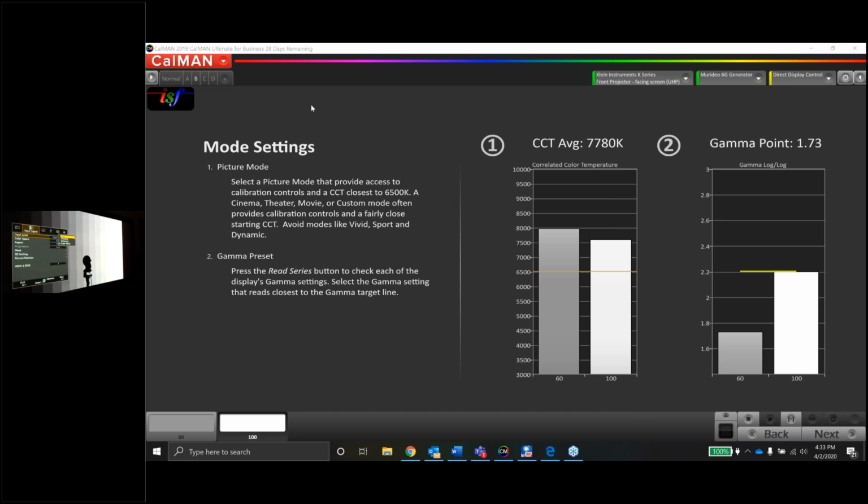And then I can barely make yours out. What's the next one underneath that? It's auto, standard, enhanced, and then super white. Okay, so standard is legal video range. That means black at digital 16 and white at digital 235. But they're not preserving anything over white.